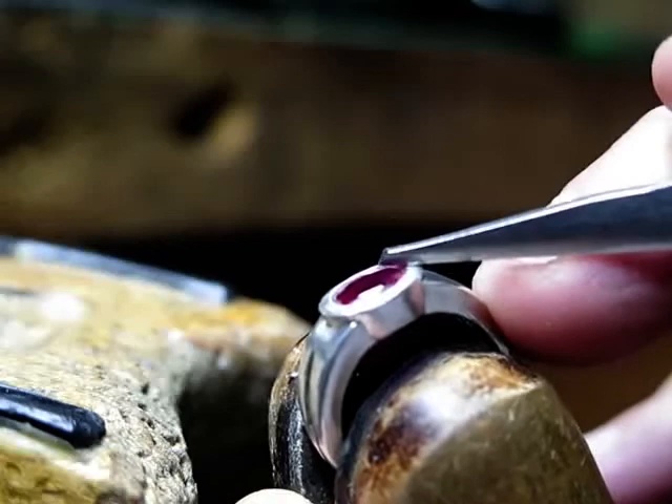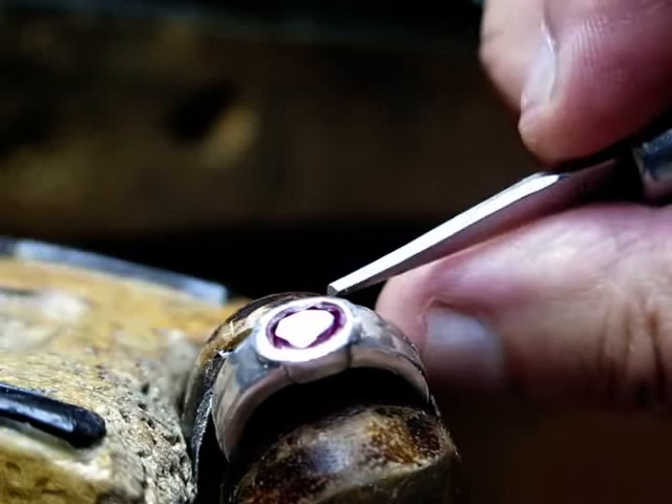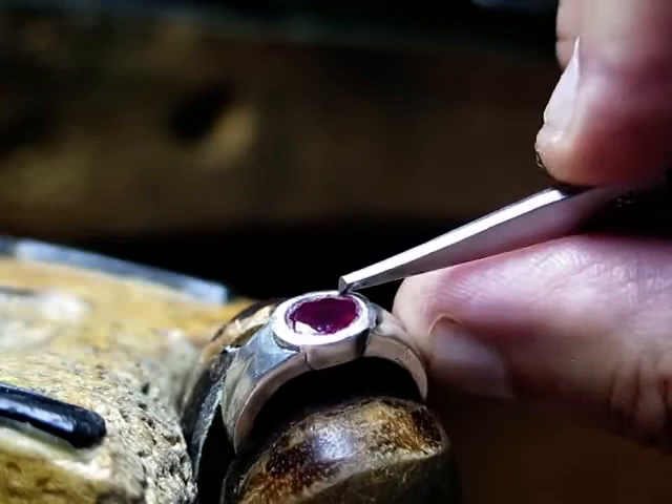When the hammering is done, the metal will be holding the stone in place. But you must make sure that the inside bezel is nice and sharp, clean, bright — as in bright cutting. And this is what I'm going to be showing you right now.